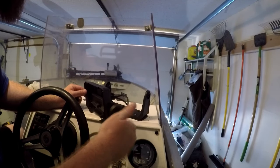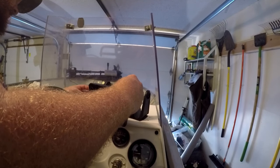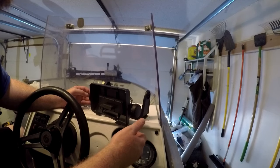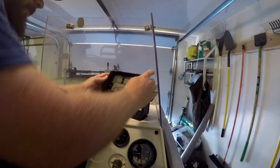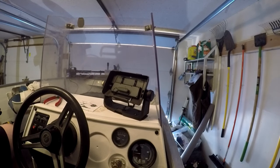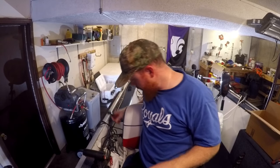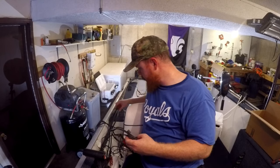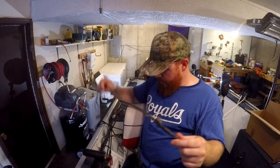Let's get the handles started and give those a medium tightening — we'll tighten those up later. It is super hot today, sorry about all the sweating. We're going to be looking for a power cord. I believe I have one right here from the old unit, and I'm going to wire it up to this Garmin. If you don't have one, you'll have to wire back to your battery. The nice thing about the Garmin is it has a built-in fuse on it, which is always a good thing.